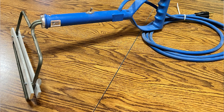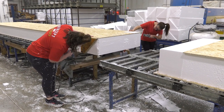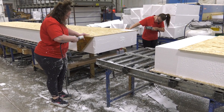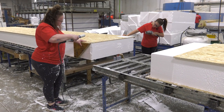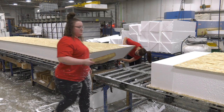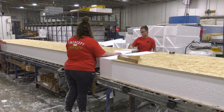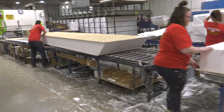Intercept can supply what are called hot knives — it looks like an old-fashioned charcoal starter, and the width of the iron is the same thickness as the foam cores, so you can use it to recess foam. Avalon makes a tool for EPS expanded polystyrene work; we used those and found them to work really well for cutting panels. Avalon also makes handles with nichrome wire over 24 feet long and a rheostat, so one person on either side in the field can cut long 24-foot panels, recess or narrow a panel, and shape it exactly the way you need it out in the field.